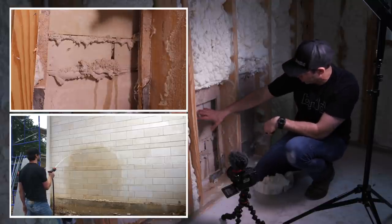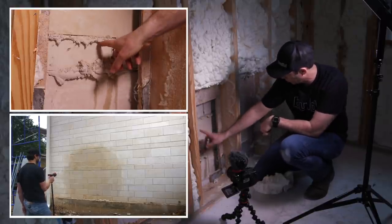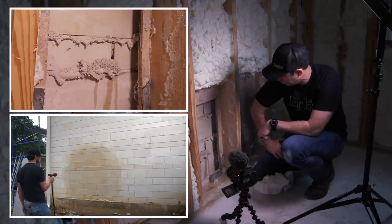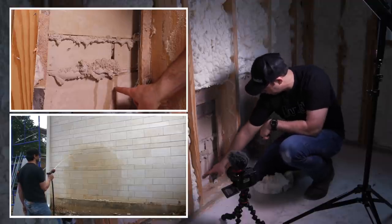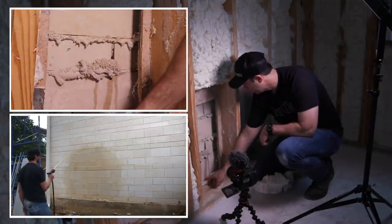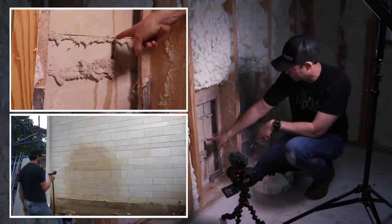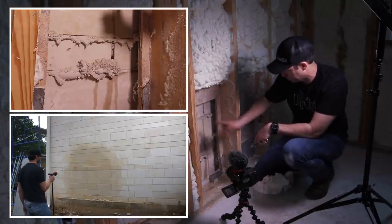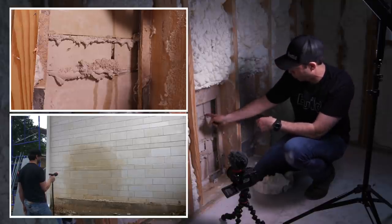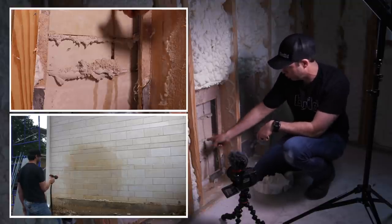I wonder how far up he's actually spraying up there. I wonder if we're going to get any coming down through here or here or here at some point as well. There's another bead right there — and this one's growing. The other joint's leaking too. So this is five-inch-or-so deep rock. This joint right here looks perfect — I don't think the mason could have filled that joint any more perfectly. We've got mortar all the way to the backside there, and yet within a couple of minutes of water hitting the face, we've got liquid water running out the back there.